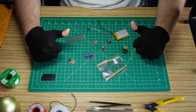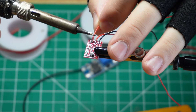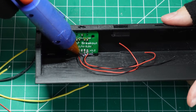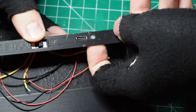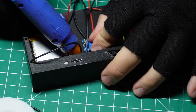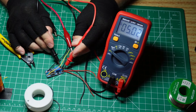Alright, let's go back to assembling this thing. I soldered cables to the analyzer chip, the power switch, the touch sensor, the boost converter, and the charging module. Once those were ready, I hot glued all of them into place inside the circuit enclosure. Then I super glued a 3D printed translucent cover for the charging LED, just to keep everything neat and protected. The battery and boost converter also got hot glued in — make sure to have already set the converter's output to 5 volts.